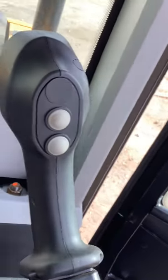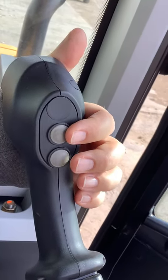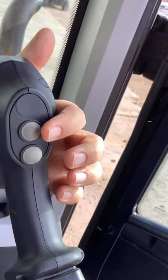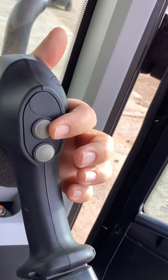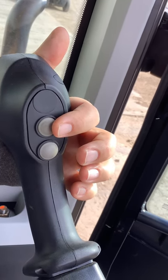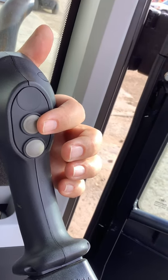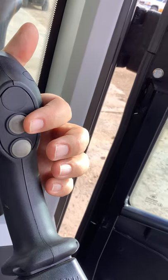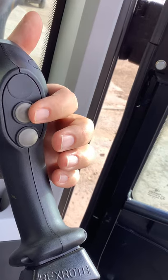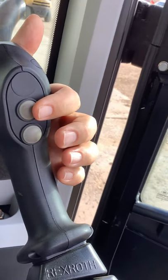On the bottom side of this joystick — I'll flip it up so you can see — there are two buttons on the bottom. The one that's further forward towards the windshield when you have the armrest down — that's going to be your constant flow hydraulics. So if you had a broom, a snowblower, or a post hole digger — something that takes constant flow of fluid to run — you will hit this and that'll turn on constant flow to that machine. You'll hear it when you hit it; it makes a different noise in the back because it turns on that hydraulic pump and keeps it running continuously.